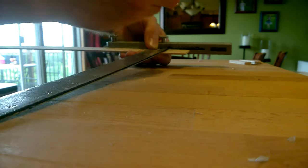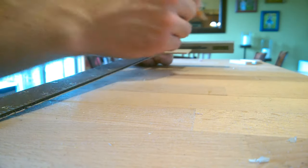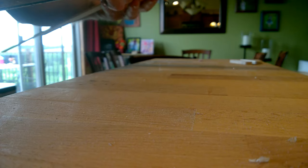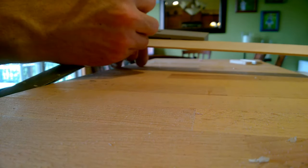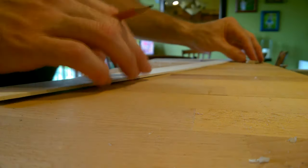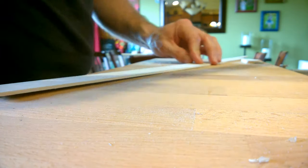For this project I need boards that are one half inch wide, which would equate to about six inches in a 1:12 scale. Use your square to mark half inch from the edge on both ends of the board, then use your metal ruler to line up the measurement marks and draw a straight line the length of the board.